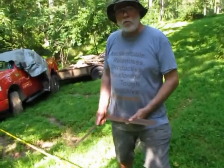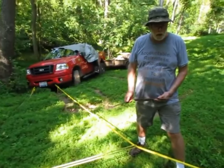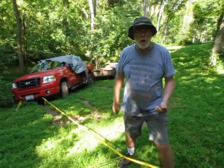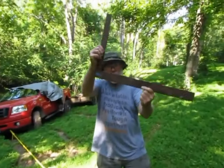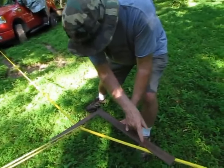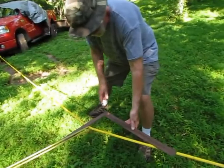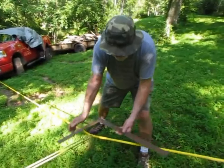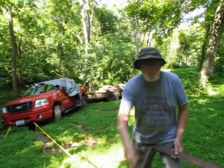The idea of the safety line is to keep it from sliding any farther — you can see that sliding would be a problem. After this yellow line was attached, I put a tensioner on it to increase the force. The most I was able to achieve pulling on this yellow rope was maybe 50 pounds. But when I put this tensioner line on there, I increased the force using trigonometry and physics. If you line up a right angle with the direction of force and note the other line, the multiplication of force equals the length of one line divided into the other. I made it three times stronger — 50 pounds became 150 pounds. And there's 150 on the other side too, so 50 became 300.